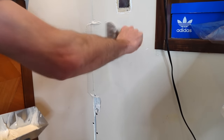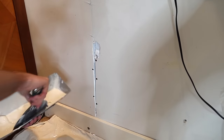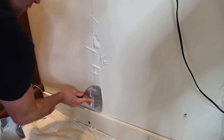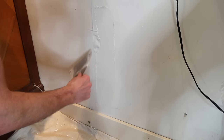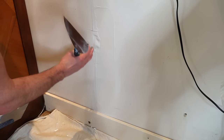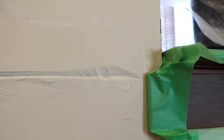Normally I would recommend letting this stuff actually set up before installing the tape. But what I'm going to do — unfortunately this is 20-minute mud so I've got to work pretty quick — is wait about five minutes for the really dry edges of the drywall to suck the moisture out of the mud, and then it'll be firm enough that I can lay some tape down and do the repair. If I do it right now there's a risk, especially at a bulbous area like this, of it just falling out and making the tape stick out, which is why I'd usually recommend pre-filling, waiting for it to set, and then scraping it down. It's now been about five minutes and you can see where I wiped it mostly flat it's pulled in — that's from the dry edges pulling that moisture in.